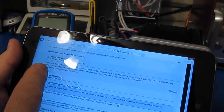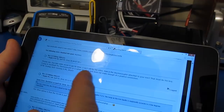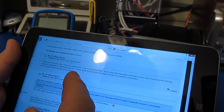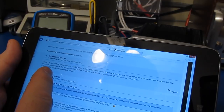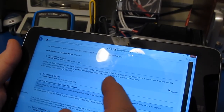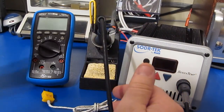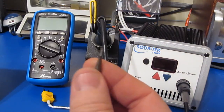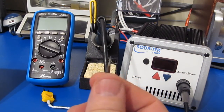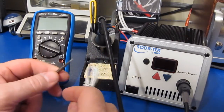After I posted the first video, he replied: 'Thanks Joe, that last video shows it can be done. I can't tell by the video how that thermocoupler is attached to your iron — that must be the key. Trying to hand hold the thermocoupler to a rather small tip just does not make enough of a positive connection.' So then I went ahead and made a second video where I used the paste with an even smaller tip — model number 357, a 1/64th conical tip — and I decided to show them how I actually connected the probe.